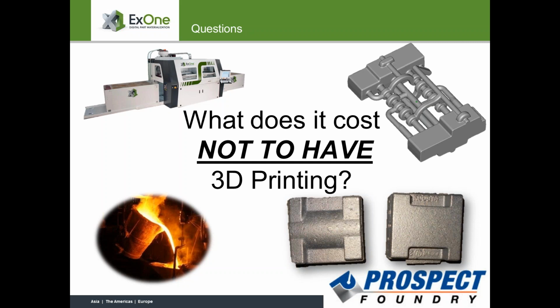Not a lot of learning curve once we got the cores in. The main thing that we considered was drilling. Every foundryman knows that you can't vent the cores or the mold too much. So our concern was we were venting the cores a lot with our process. So the question was, are we going to need to drill these cores as much, or in the same places? But it was very little, and we didn't have to.